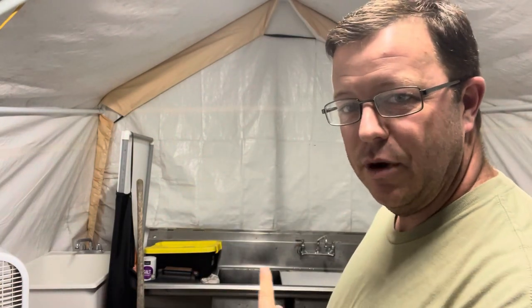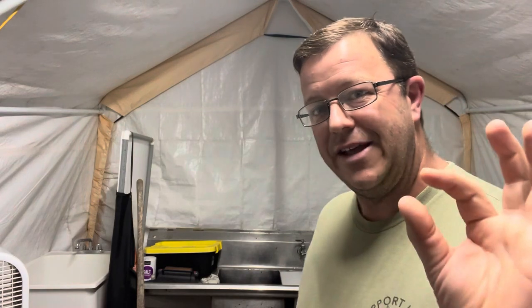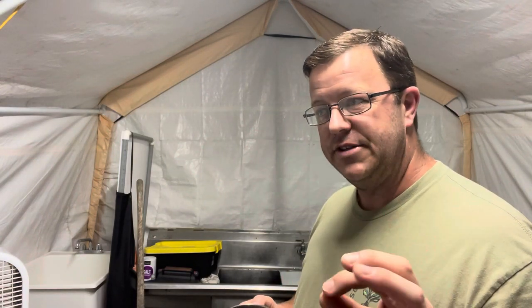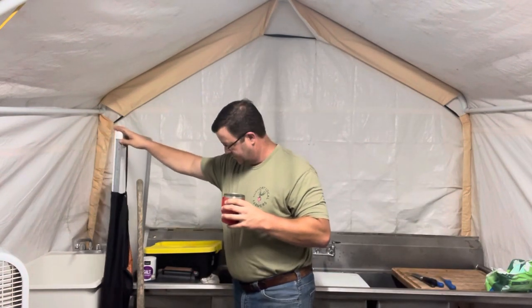So we're at a gravel floor for drainage. We're at a building because we have to eviscerate inside. We had to have a 3-compartment sink and a hand washing sink. So then we had to have hot water. So we have a camping propane powered gas water heater. Then they told us, well, your hand washing and your 3-compartment sink have to have a barrier in it so there's no cross-contamination. So I took some PVC pipe and a piece of plastic beadboard, and I made a barrier between them. It's just got T pieces down on the ground for legs. So that created my barrier.